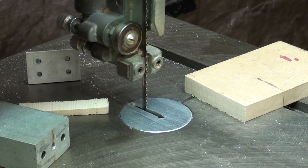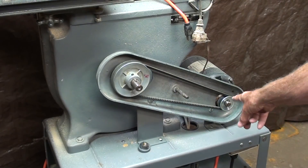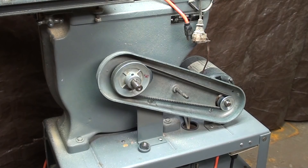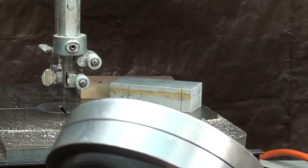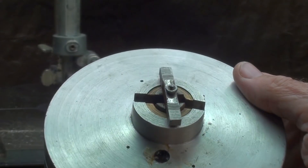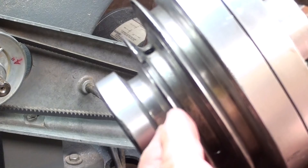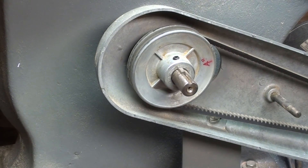But what we're concerned with most here in my metal shop is cutting steel. So in the next video, let me tell you what I'm going to do. Taking the cover off, you can see there's a four-inch pulley here and a two-inch pulley here, for that two-to-one reduction. But in the next video, in order to greatly reduce it, I'm going to use the pulley gear — and you've watched several videos where I rebuilt this. This is a planetary drive that reduces four-and-a-half to one ratio. I'm going to mount this on the motor, probably have to take that guard off and use a different size belt. That's going to reduce the speed greatly, depending on what pulley I use, to reduce it down to a metal cutting speed of one or two hundred feet per minute.